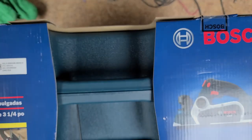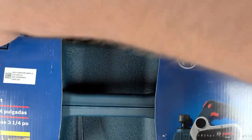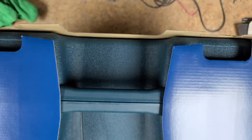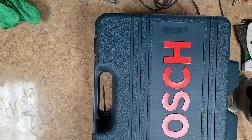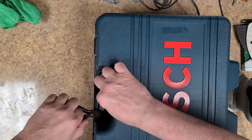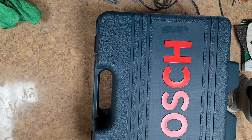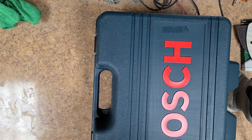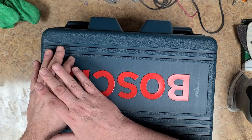So it's Christmas time. What I ended up doing last night is I went out and I purchased a Bosch electric hand planer, and this is going to help me out a little bit. Brand new. Yeah, Bosch. All right, I'm going to cut this wire tie. I'll have to complete the sanding with the 50 grit in order to remove the remainder of the veneer and get the top basically where I need it to be, just as a mahogany top.